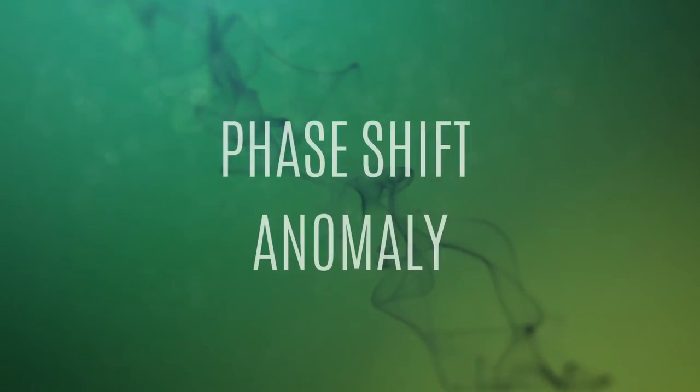For the next experiment, I will add a parallel capacitor to L3. This will tune L3 down to resonate at L2's resonant frequency. Both L2 and L3 will now have the same frequency, but now we will have two resonant frequencies.